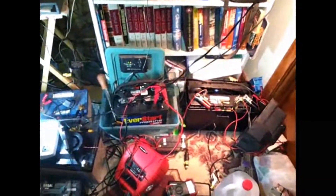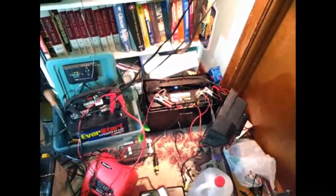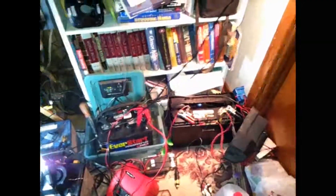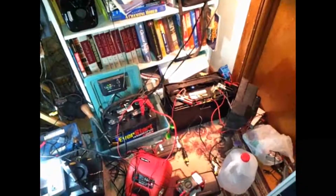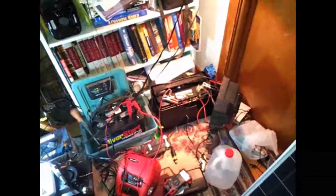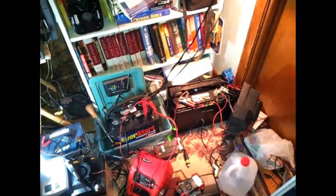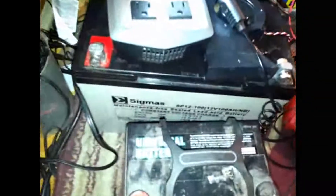So what I'm thinking is I'm going to try either getting an AGM battery to hook up to the system. This system is running off 100 watts of solar and is also tied with a grid tie inverter. That wattage could change, especially since I have my new solar panels here. I'm going to try an AGM battery if I can get one from a battery distributor at a really discounted price — maybe look at some used or blemished batteries. Because I already spent my money on the solar panels and didn't expect the battery to fail. I can get blemished or used batteries for around $35 to $40 a pop with core deposit — definitely a lot less than paying $150 to $200 for an AGM battery.